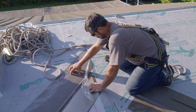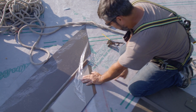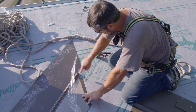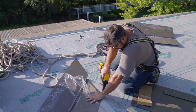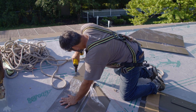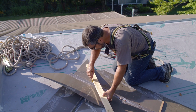That is what we're looking for — I want this point here to intersect right in the middle of this line. That way we bring this one up to the center line, and our laps go from there. Once the first valley is prepped and pinned in place with a few temporary fasteners, Matt starts working the next valley piece by marking the location of the ridge and cutting a little extra for the tab.